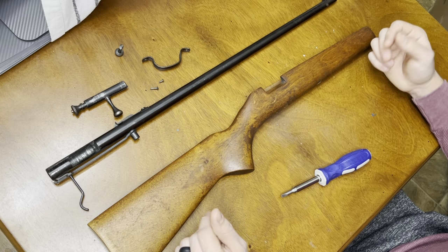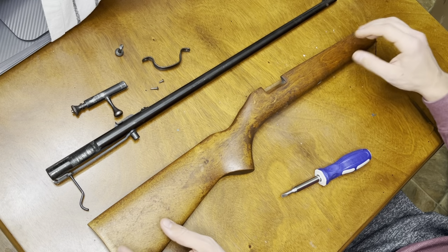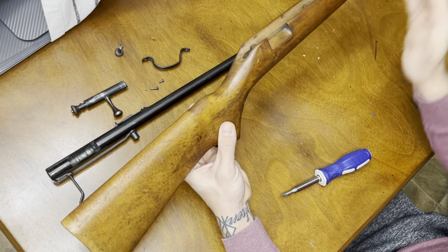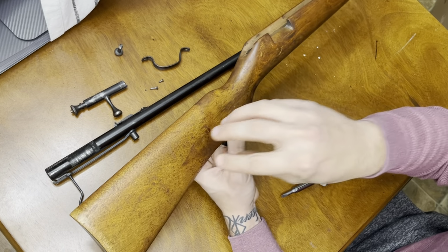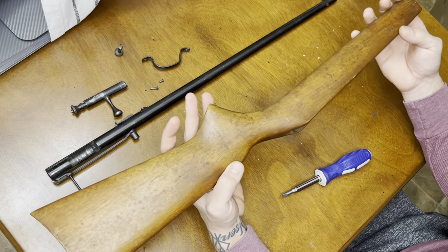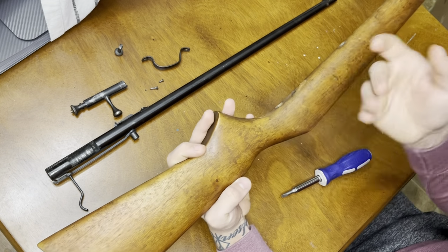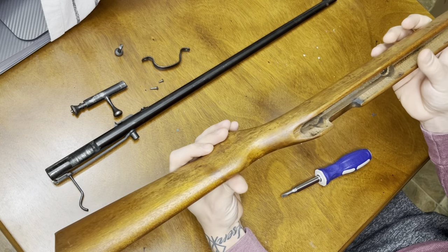And we have a pressure nozzle, so I can turn it from 100 down to 30 or 40. So we will very lightly blast this off to get all the varnish off. That way, when we do put it in the oven, the varnish doesn't screw up the Cerakote. And hopefully we can get some of this, there's a little bit of rot in a couple places. Hopefully we can get some of that out.